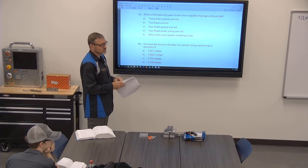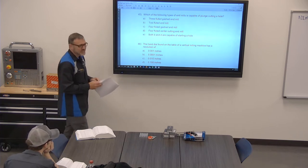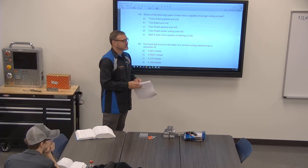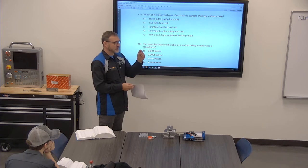Why don't you get it down to the right size? Well, I'm supposed to get down to the right size if I can't get it in the lathe. Put it in a 4-jaw chuck. Put it in a 5-jaw chuck. There's a 5-jaw? No. Interesting. There is a 6-jaw chuck. We don't have a 6-jaw chuck. Can I do 4-jaw though? I would. The only hiccup in the 4-jaw chuck is 3/8 is almost too small to get those jaws together.